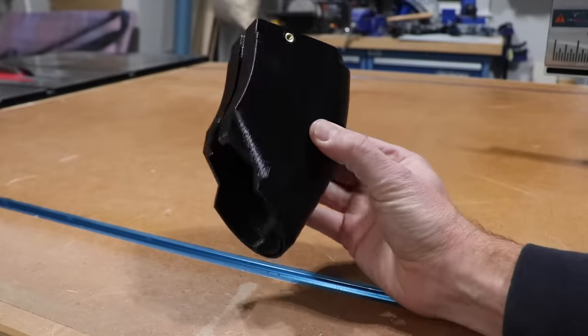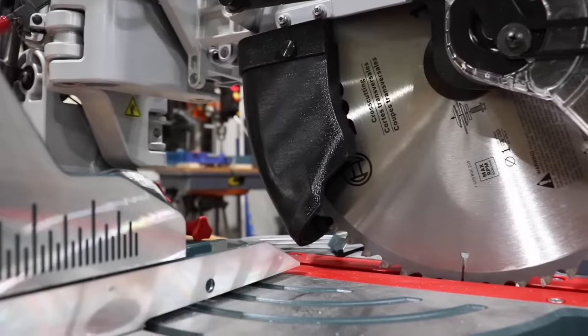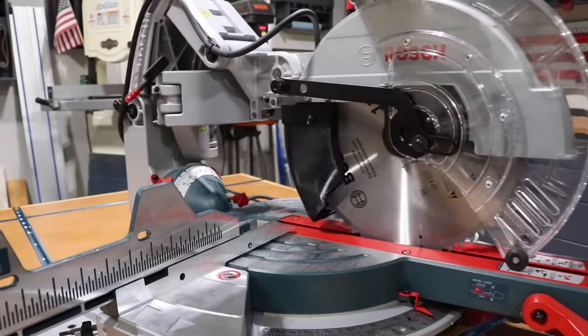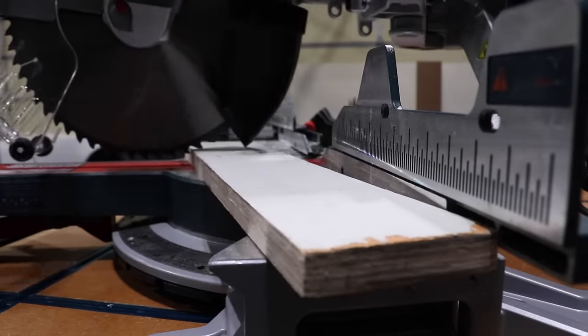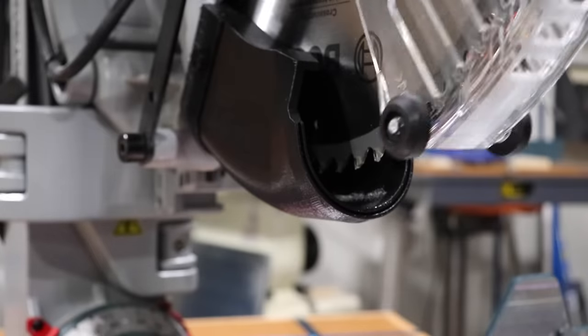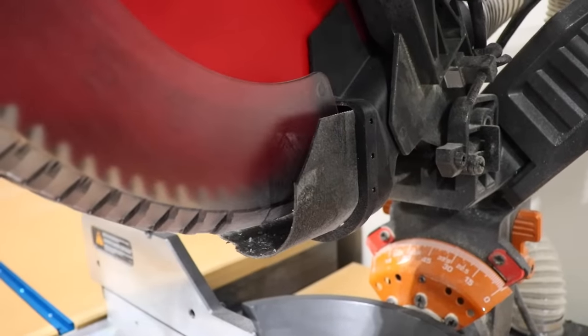The mating piece on the chute itself fits securely into the mount and attaches with two thumb screws, one on each side. For the design of the chute itself, this was my first pass. It conforms to the shape of the blade nicely and extends all the way down to the point of dust generation, but it's a little too intrusive — not much room for the materials you're actually cutting. As soon as you start moving the saw around, it gets in the way, and as the blade guard comes down, it interacts with where the flap is.